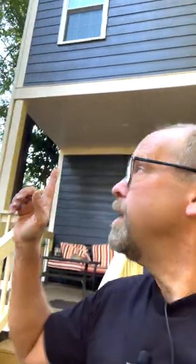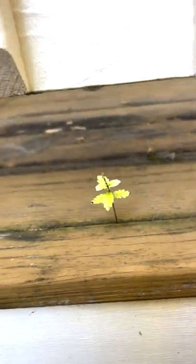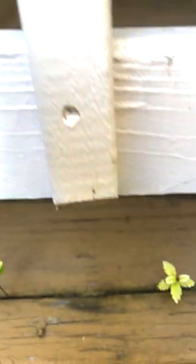I see a GFCI outlet on the back, accessible from the deck. There isn't a second floor deck — that's the house there. So a couple of things on this back deck. At that wood rot area, I'll take a look at the underside of the deck. Under the deck, there's plastic under the floorboards — not sure why they did this — and it's holding moisture. That's why we have some wood rot here, possibly, and some other deteriorated wood. I don't think they need that plastic.